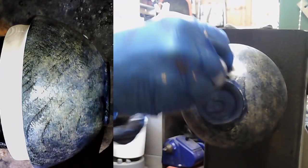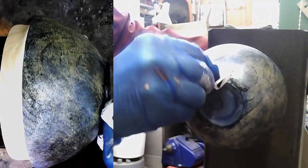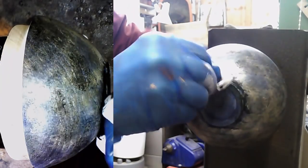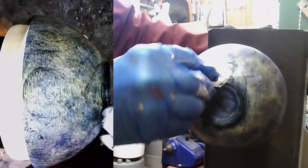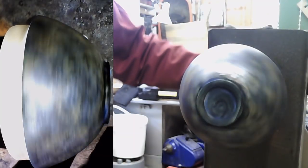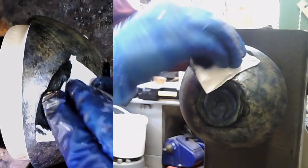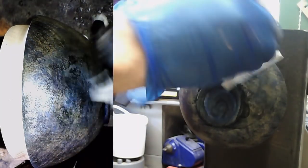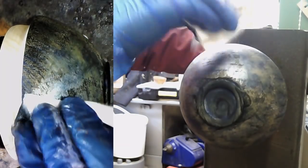Okay, now down the bottom there are still a few bits of bare wood showing around this foot, which at the moment I'm intending, shock horror, to keep. I can see, looking from a particular angle, there's a bit of loose, or very open grain there that's soaking in the stain a bit more.